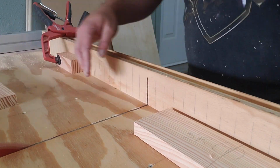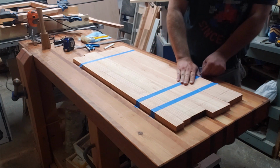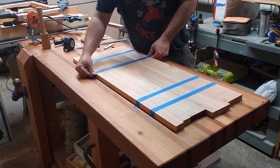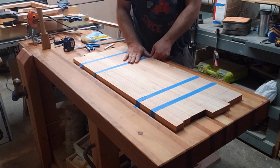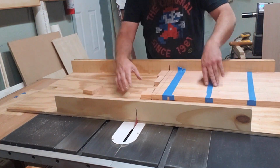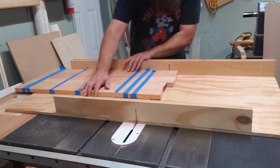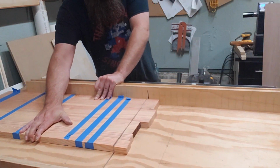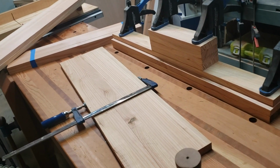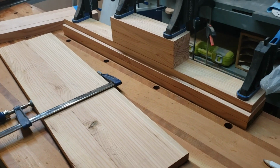These are the side assemblies that I'm cutting. I need 4 of those to all be the same length, so cut those at the same time too. Here I am ganging up all of the front and back pieces that are all going to need to be the same length. We'll cut those all at the same time too. Gang them up. Make sure everything is going to be the same length. That way you have a really good chance of everything being square at the end.